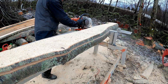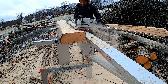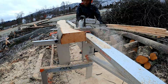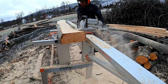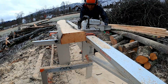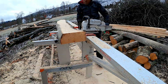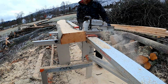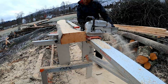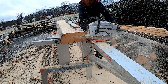The saw is a Stihl MS880 — the biggest saw they make. It's a tremendous machine, quite powerful, and as you can see it just chews through this hard maple like it was butter. The bar I'm using here is 21 inches, which is a bit short for the biggest logs I milled, but my other bar is 48 inches. I bought it used and it needs reshaping and resharpening before I use it, and I didn't bother doing that before I started milling.